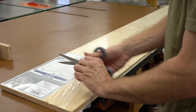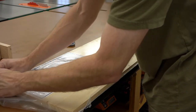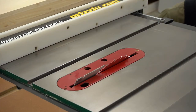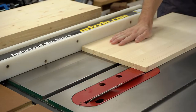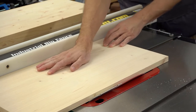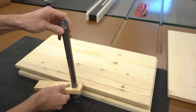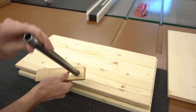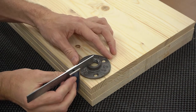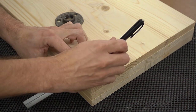Next, it was finally time to start on the shelves. I decided to keep it simple and go with 12-inch wide, edge-glued shelving panels from Lowe's. I started by cutting each shelf to length at my miter saw, and then headed over to the table saw to cut a small chamfer along the front edge of each board, though this could easily be done with a block plane or even a sanding block. I then did a quick test to determine which drill bit size to use, which for this half-inch pipe turned out to be a 7/8-inch Forstner bit. After determining the hole locations for the legs using an inset floor flange as a guide, I clamped three shelves together and then drilled each of the holes at my drill press.